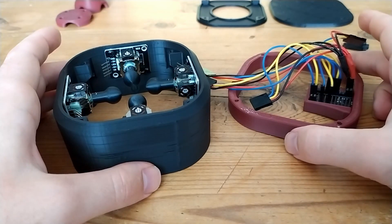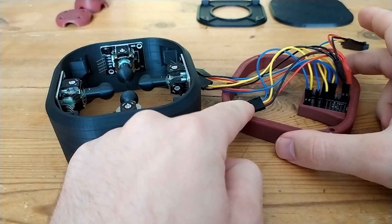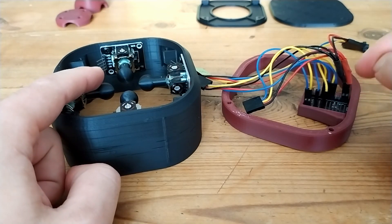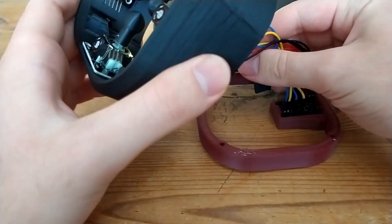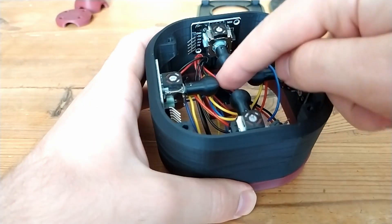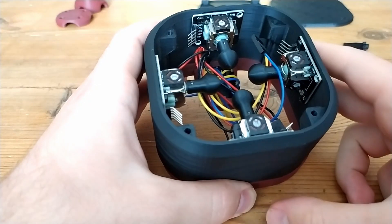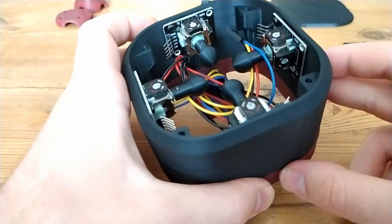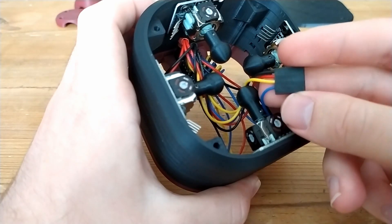Now is the best time to make up all of the wiring. You'll have to wire power and ground as well as the signal wires to all of the joysticks. There's a wiring diagram on the original download for this so I won't go through that, but you will have the A joystick facing you. Put on the spacer temporarily and try to measure out the wires from the controller up to the different joysticks. I've marked up which joysticks the wires are for, so just go ahead and plug them in.